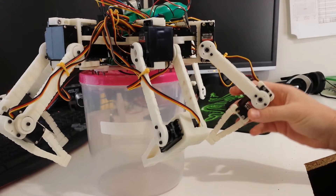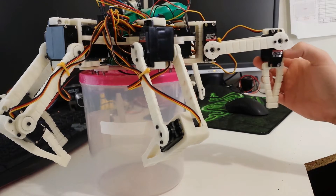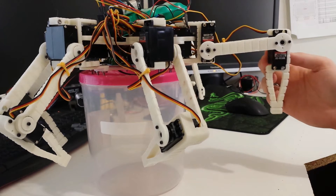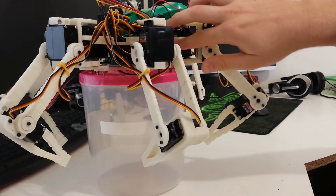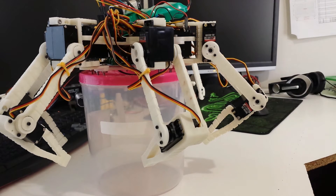These tibias are the same length as the femur. I plan for it to walk with horizontal femurs, just kind of walk like this. I had short tibias initially — I thought that would be a cool looking walking gait. But although the servos do just fine and have plenty of torque, the 3D printed chassis is printed with a very low infill so it's a little flexible and warps under the moment. So I need to redesign the chassis to improve structural integrity, or maybe send it off to get laser cut from aluminium.